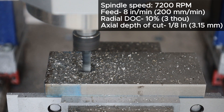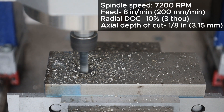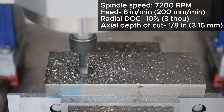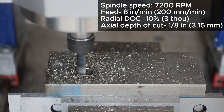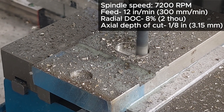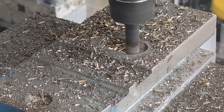That is not bad at all. I have also reduced the axial depth of cut — not because adaptive clearing can't handle it, but because I wasn't sure if my ramp value (the speed at which the tool reaches the axial depth of cut) was accurate enough to safely plunge to a high depth. I have been using a slow ramp feed of 2 inches per minute (50 mm/min) throughout. With that attempt successful, I applied the adaptive clearing principle again — reducing the step over to 8% (2 thou) and increasing the feed rate to 12 inches per minute. That worked very well. Then I ramped the tool to the full axial depth of a quarter inch, and the desktop DIY CNC was able to mill the notorious 304 stainless steel at a decent material removal rate.